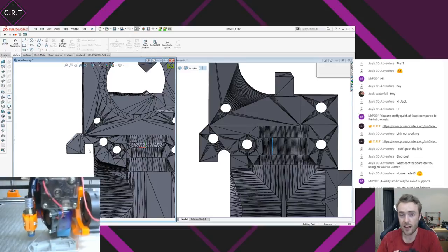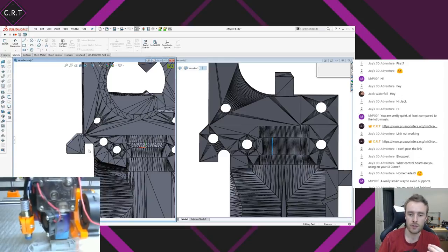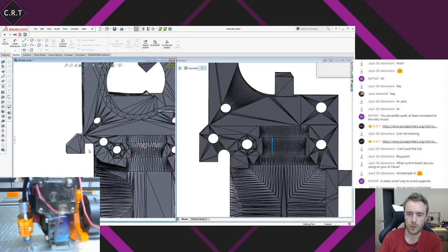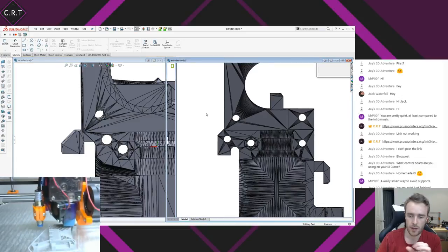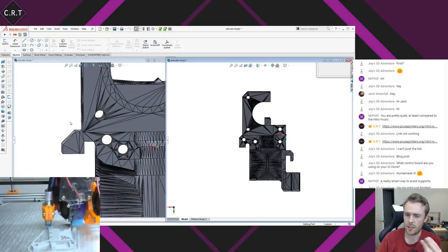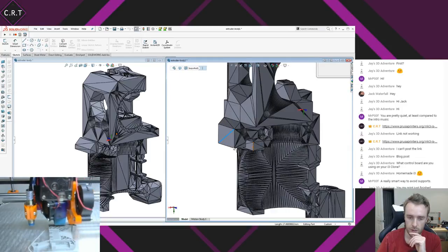So previously they only had a 2-pin fan. So you have your ground or neutral and the 12-volt line. Set RPM, or you can fluctuate it with voltage. Whereas this one, you can actually measure the RPM. So it has a third signal cable, which I believe outputs a variable voltage. And so you know what the RPM of the fan is currently.